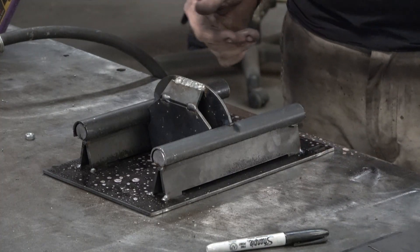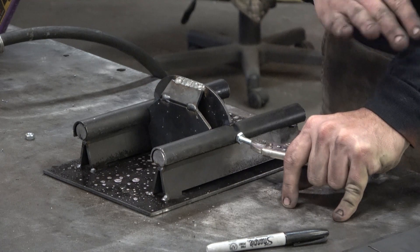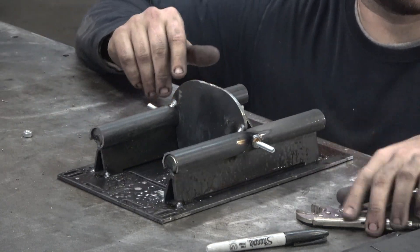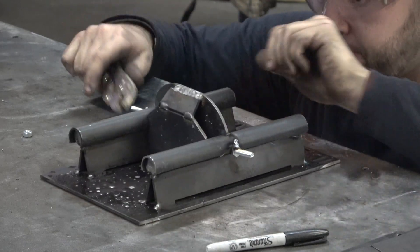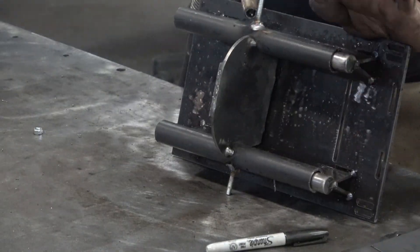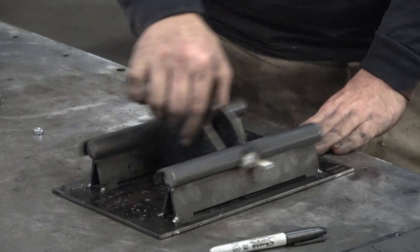Next step: we need to weld on a bolt. These are quarter-twenty inch long. It's going to go on the side of these two pipe sections in line with the bottom of the carrier, coming out 90 degrees, flat to the table, parallel to the back plate. Get a tack in on both sides of this, then adjust until they sit nice and level where you want them. Make sure they're in line with each other and the bottom of this plate. Weld those out. After each step, make sure that everything still operates smoothly.